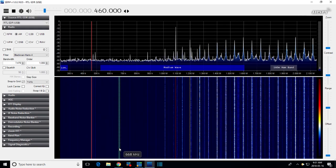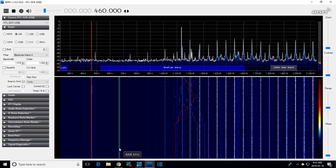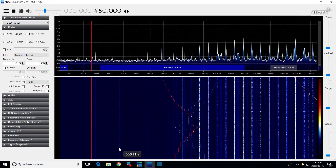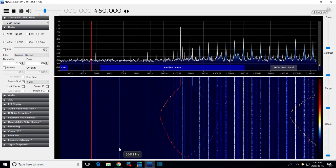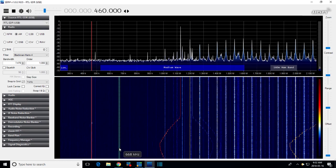Well, I don't think this is showing us anything. Can I tune the radio? Well, you know what it could be? It could be that I'm looking for a problem with the front end tuning. Maybe there is no front end tuning, really. By the time the signal makes it all the way here, there's really nothing much left of it. Or really, what we're looking at here is what the radio is capable of receiving right now, which is nothing but noise, as I tune it.